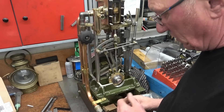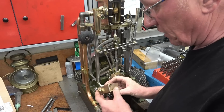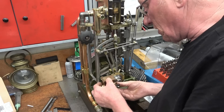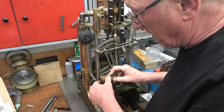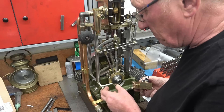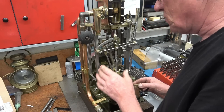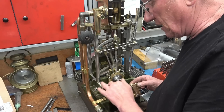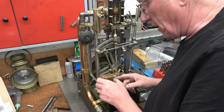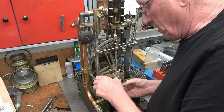A few weeks ago I did some video on this marine steam engine discussing this little mechanical lubricator pump, or oil pump. I've decided really the only place to fit it is on there. That surface there I've started to file it flat because it's been a casting - it's all tapered, nothing is actually flat. I don't want to strip the engine just to machine that flat because a file finish will be perfectly adequate to mount that on.